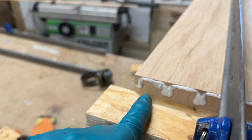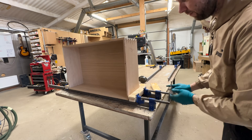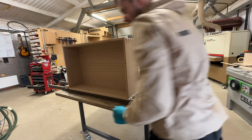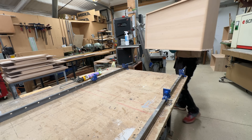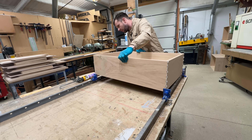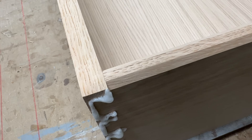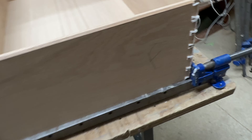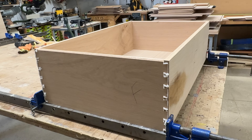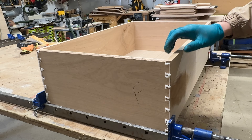The main thing to watch is the drawer bottom because that's where everything is quite tight — that's the tricky bit, getting it together without knocking the sides about. Move over to the other set of clamps. This stage isn't necessarily essential — if your dovetails are absolutely perfect they should be fairly tight anyway — but it's a way of ensuring they're perfect. I like to clamp all four corners, putting a clamp top and bottom through each side to really pull the joints nice and tight.